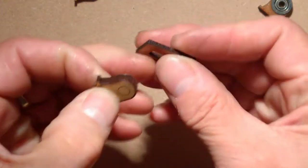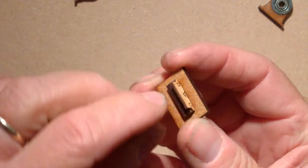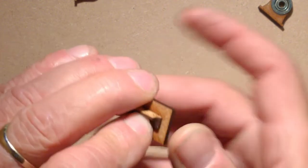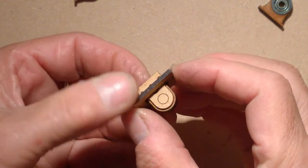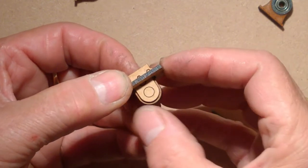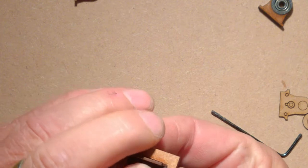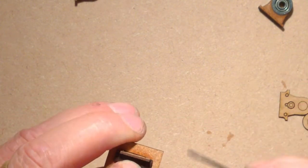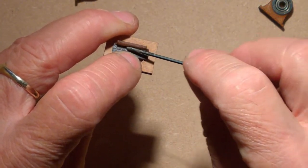And then we take the jig, we pass it through, and we push them both down firmly into the jig and firmly in that direction. And just check that we've got the same ridge running all the way around, that it's central. And just hold that for a few seconds, and then you'll need a knife blade to remove the excess glue that is shown running along there.